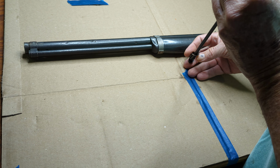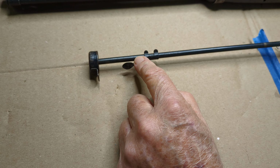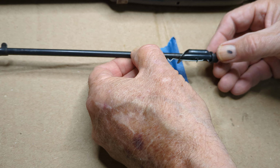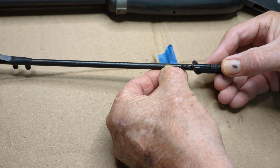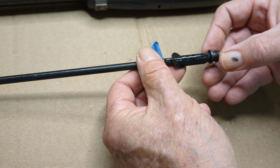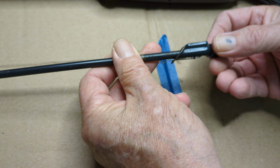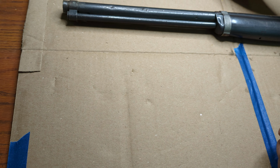And our shot tube looks pretty fair. The keep-the-BB-in tab in the barrel shroud is in place. The BB retention spring, the device that keeps the BB seated in the chamber, is in place. You can see a seam down the barrel run, but it's not open, so it should be fairly airtight. The shroud and forcing cone look to be in good shape, and the abutment threads look to be in good shape. So that's a good sign. Shouldn't have an issue with that.